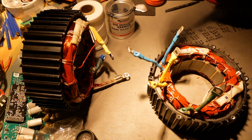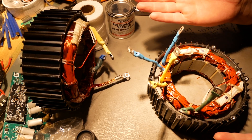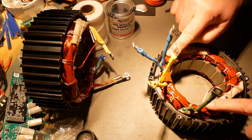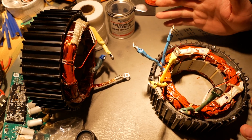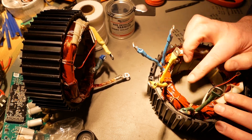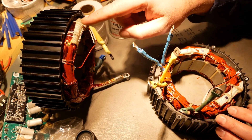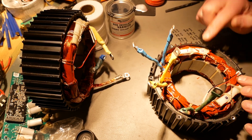Since I had these separated out anyway, it makes sense to do this. They're ready to be used as a single motor by connecting those two together, or to run as two separate motors. I have added red varnish on here. I did not rebind this side — unlike the V1 motor, this was all pretty well done. There was no real point in pulling all the binding back off and tightening it back up like I did on the V1, because over there it was all really loose — that was a much poorer job.